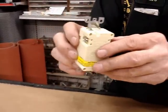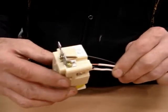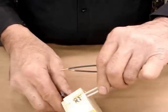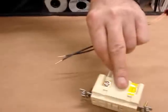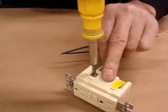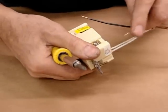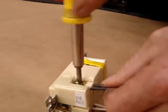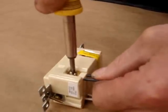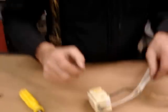When we take out a regular receptacle and go to install this, we put the two white wires in the white holes and tighten the screw, which clamps those wires in. We install the white wires and tighten all the screws. We tighten them up nice and snug, then come back after a few minutes and tighten these screws again. After the metal gets clamped in and conforms to the clamping, you can come back later and get another turn on those screws to make them tighter.